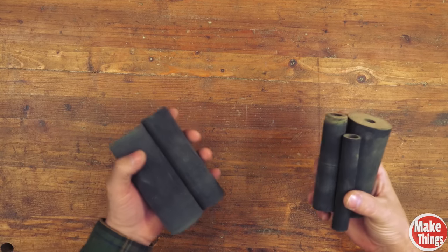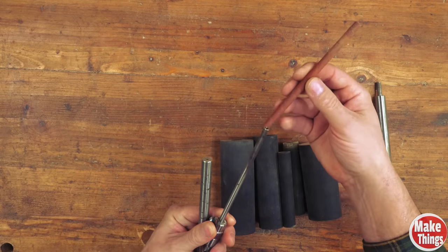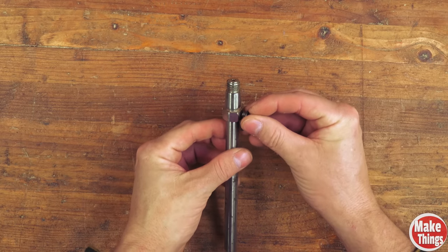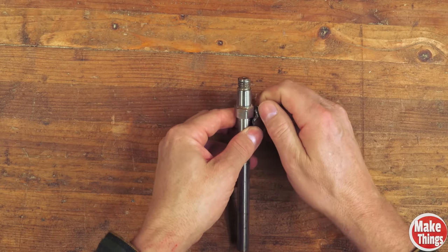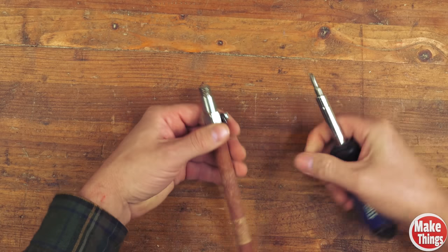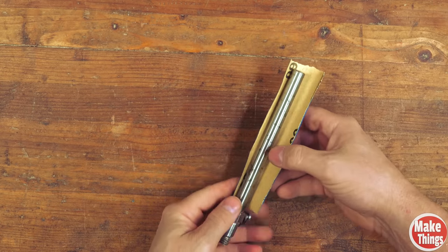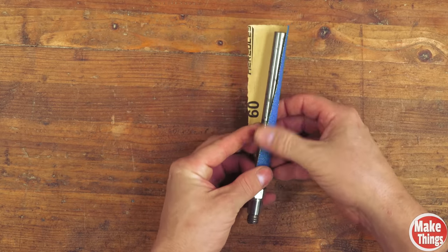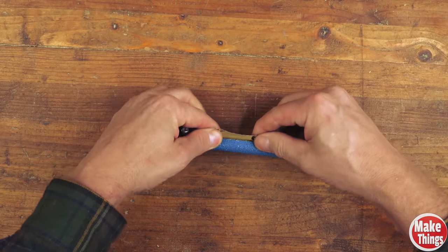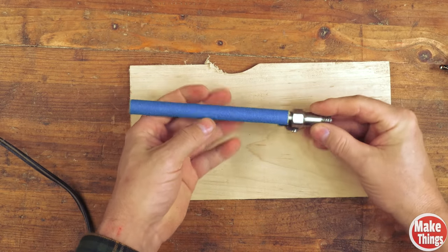This method works great when you have rubber spindles, but the smaller spindles on my oscillating spindle sander use a steel stud. For the smallest stud, the sandpaper slides on like this. This isn't a problem with my Jet, as I have a little clamp that each of the smaller diameter spindles comes with. The way this works — it slides in here, and then I use a screwdriver that locks it in place so it can't move. The same thing can be done with the sandpaper. It's going to wrap in the opposite direction, and since mine spins clockwise, I'll wrap this counterclockwise. Then I can go ahead and clamp it down, and that's ready to go.